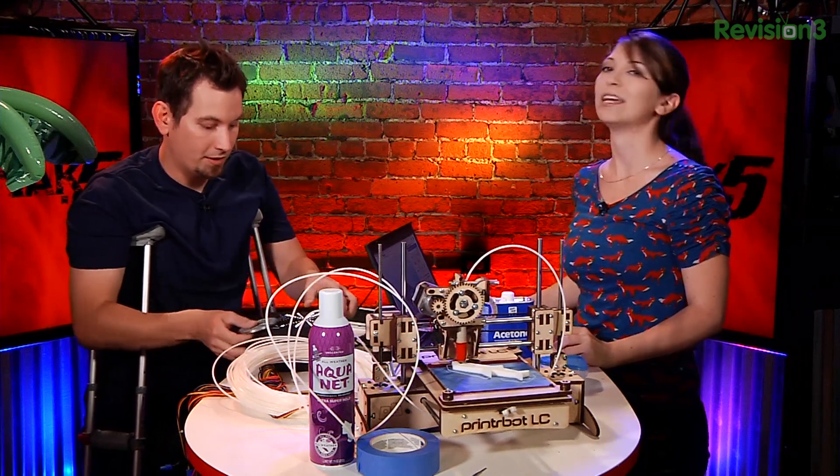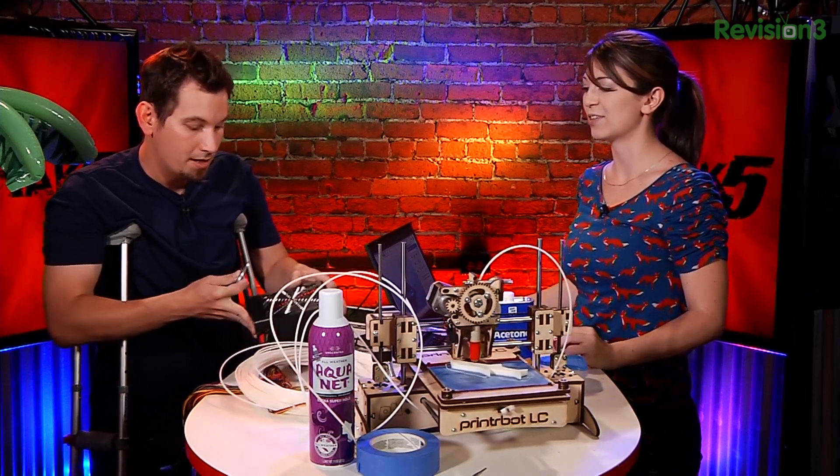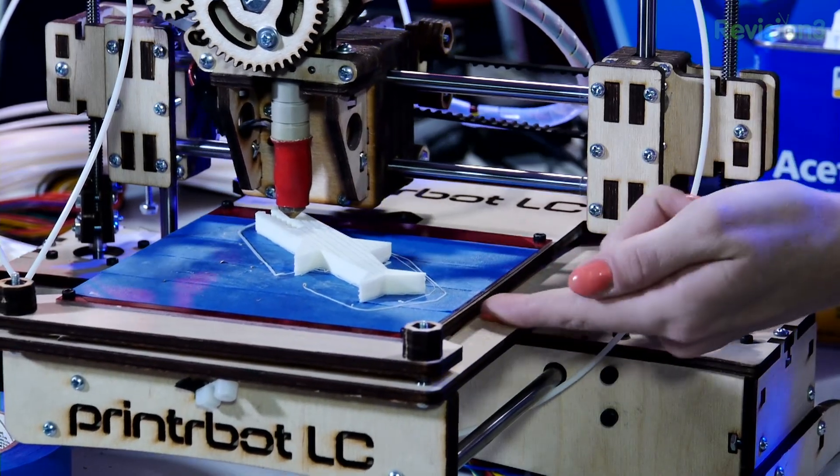I took a spin around the forums and the main thing people were saying was buy a bigger power supply. This whole printer is running off a PC ATX power supply — this is 350 watts, which should be perfectly fine for this kind of printer bot. You can also check a couple of other things: there's a thermistor cable on the bottom, and you want to make sure that's directly on your heat bed with no separation or obstructions. You can also stick corkboard or something thermally resistant underneath the print bed to add insulation so you stop losing heat out of the bottom.